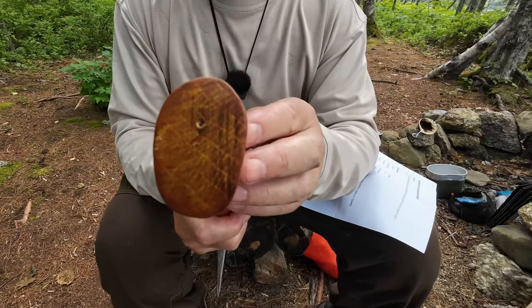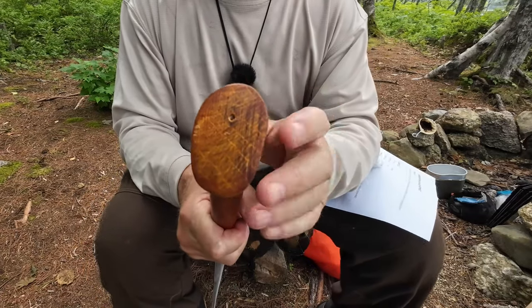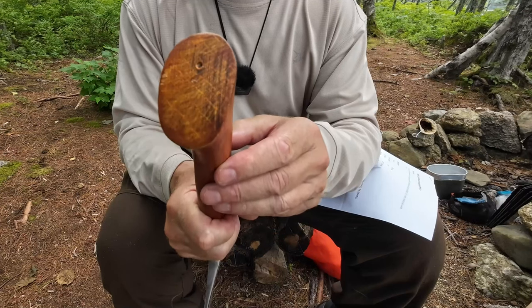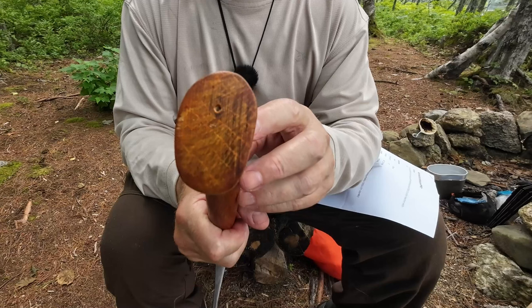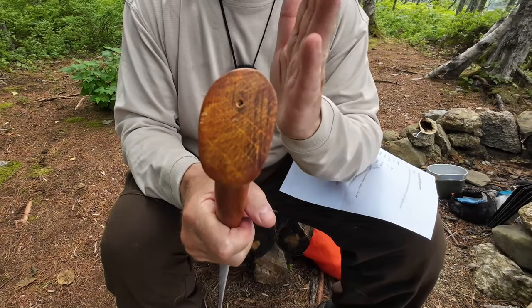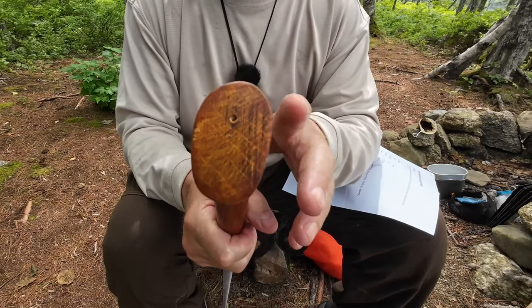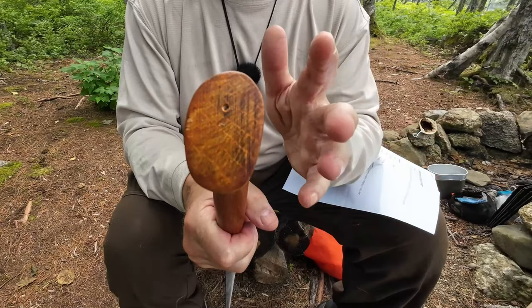First off, grain orientation is just a little bit better than 45 degrees. And I won't know until I edit this if this is going to show up. But what I want you to look at is the width of the grain. How many bands are in there? This is outrageously poor. This is a very soft wood. Even for beech, this is soft.